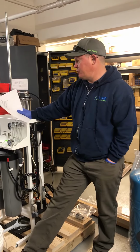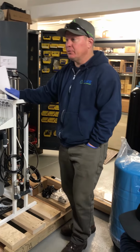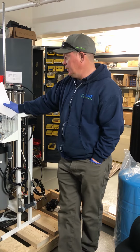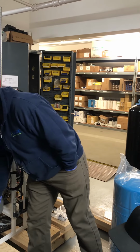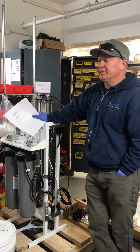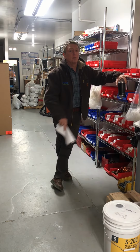I briefly wanted to go over pre-treatment. BT-1500s, or any RO for that matter, whether it's an under-sink RO or a whole house RO, does not like iron, does not like hardness. Those are two things that will just destroy the membranes. Manganese, tannins, chlorine too. That being said, typically you're going to see an iron breaker minimum upstream of these guys. In most instances, we're doing the S200 chemical to take care of the hardness, but in some instances there's a water softener upstream of it or a sanitizer. We've got one down in Washoe Valley where there's a sanitizer and an iron breaker upstream of it. So that's what we were talking about, is when you go to these jobs and they're still getting iron bleed through, we want to put 2 iron filters before these, right? Yeah.